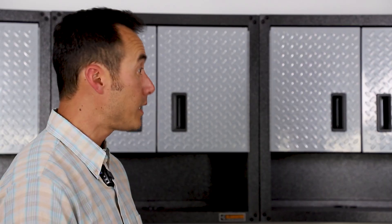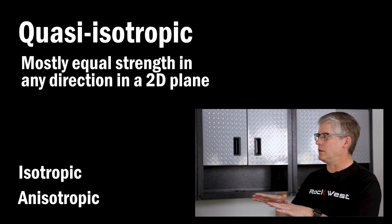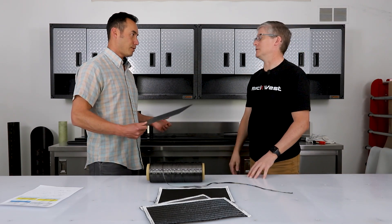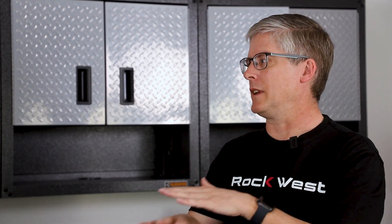I've seen isotropic, anisotropic, and quasi-isotropic — what's going on there? Quasi-isotropic is when you have equal strength going in any direction in a plane. Carbon fiber, as we know, is only strong in one direction — that would be unidirectional. So when we lay up plates, we can make them isotropic or quasi-isotropic. We build layers up, each layer having strength in one direction. We build a balanced layup, which usually consists of four plies going in four different distinct directions, and we can get a balanced layup that is quasi-isotropic in the plane of the fabric.